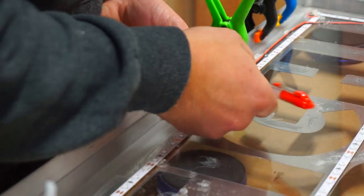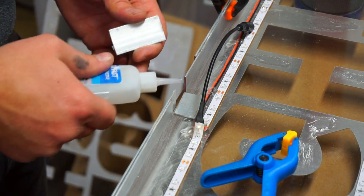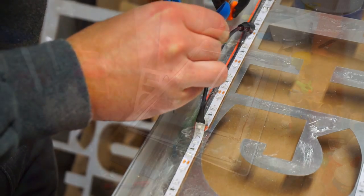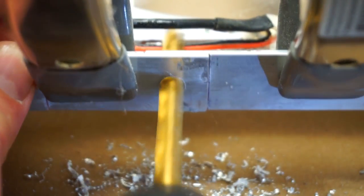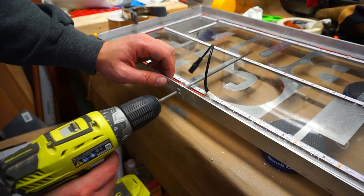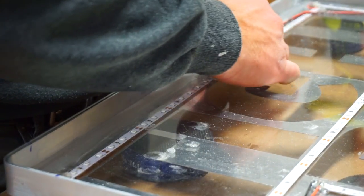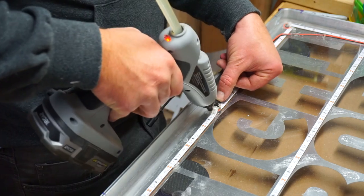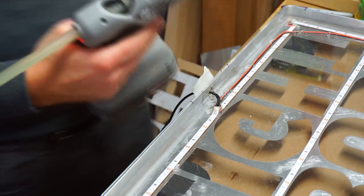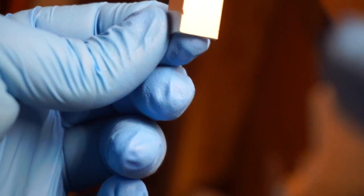The piece to wrap around the outside edge was a little bit small. After marking, I took them to the bandsaw and cleaned everything up on the belt sander, then glued and clamped them into place. Next I marked where the tabs went and used a center punch to mark where I would drill a hole to get the electrical cord out the bottom. I started with a smaller drill bit and worked my way up gradually. The largest bit I had wasn't quite big enough, so I mounted a rat tail file in my drill and hogged the hole out. Once large enough, I passed the electrical cord through and added strain relief so the hanging cord wouldn't put stress on the electrical system. I then used CA glue with activator to mount the tabs — stuck them together, held for a couple seconds, and they're not going anywhere.